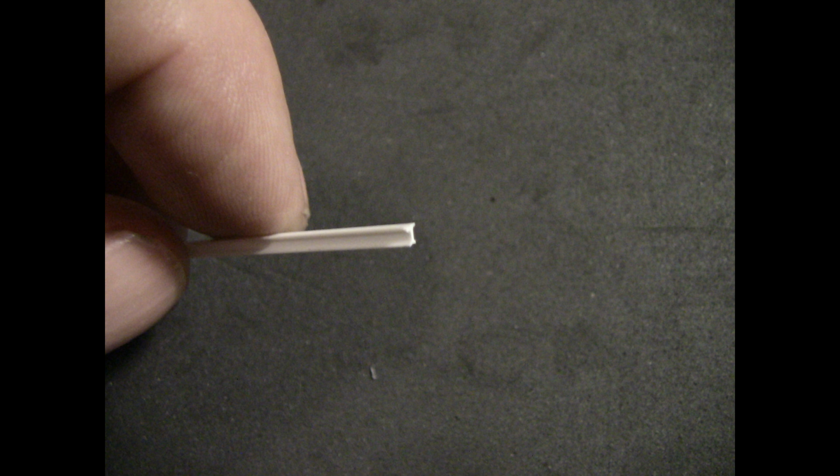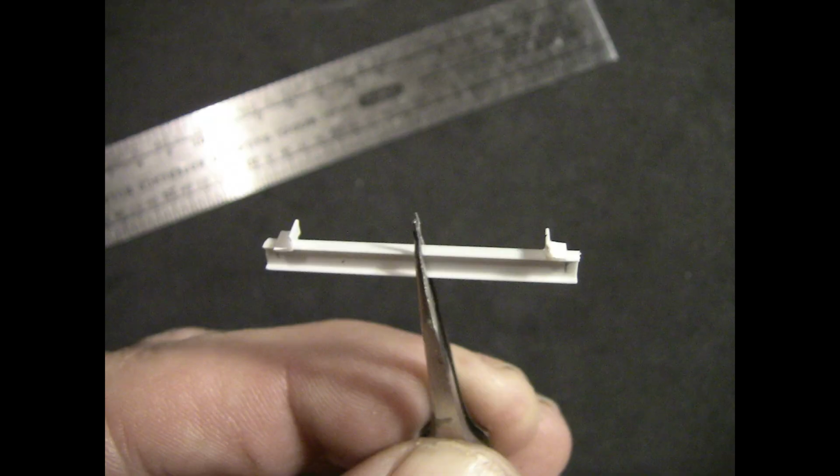Now across the top of those, there's an I-beam that crosses across those, and I want a way to set those angles, the tubing, up on top of those. So I cut a couple of angle iron pieces to glue to the top of that I-beam, and then I just inset them just a little bit where that tubing will come up across and glue them to the I-beam.